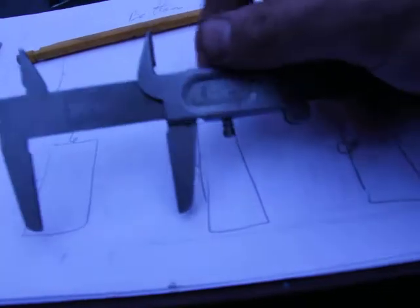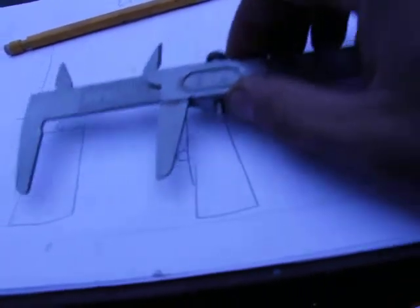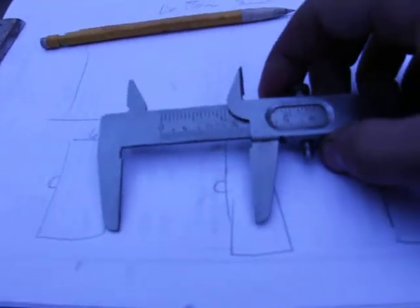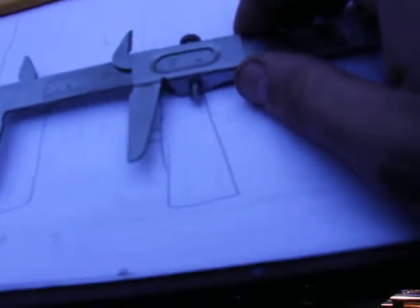And what's interesting about this is that the entire vernier scale represents only the smallest division on the main scale. There's actually a demonstration on YouTube. I don't think you'll be able to see this here, unfortunately. But only one of the lines on the vernier lines up to a line on the main scale. There's never 2 of them lining up. Some of them might almost line up, and then I think you take the smallest measurement.